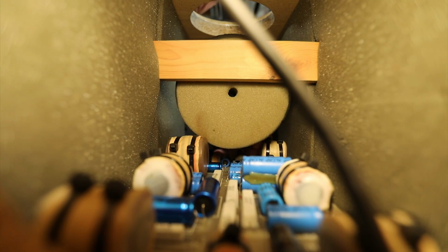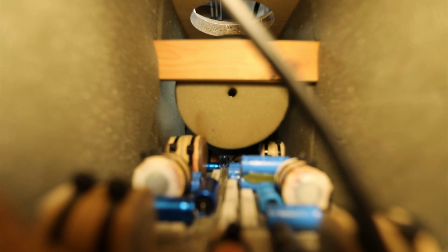It goes back the same way it came out, through the bottom. Notice the 6 posts which the board has to be seated on. Once the board is properly seated, install the 6 lock washers and wing nuts. Reattach the wiring harness. This harness was offset upwards by 1 pin. In other words, it is connected to all the pins except the bottom pin.